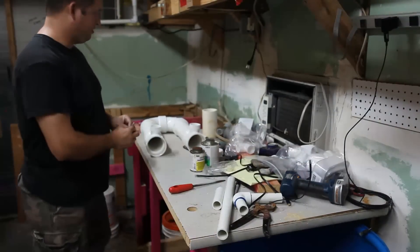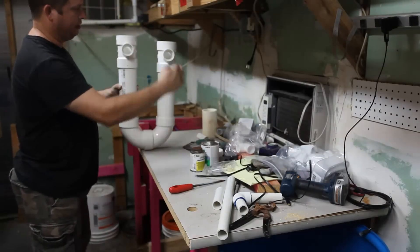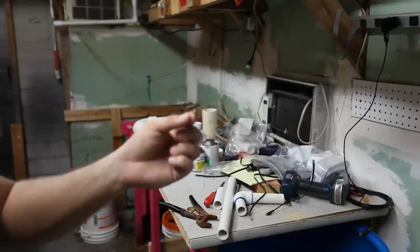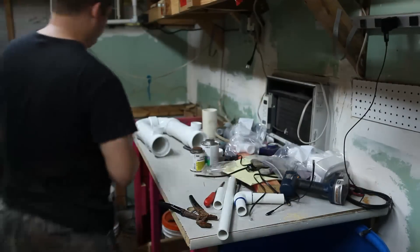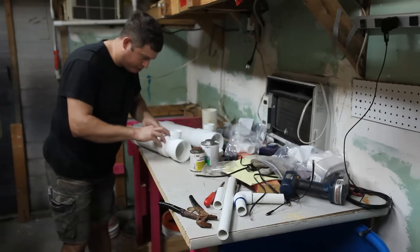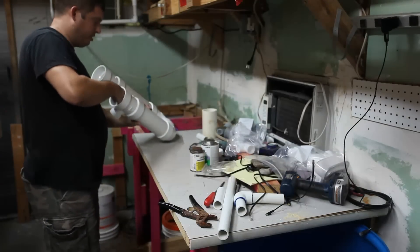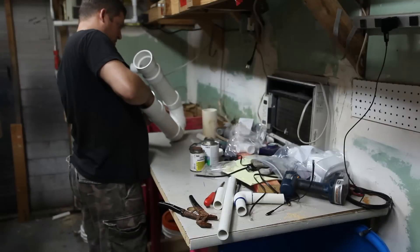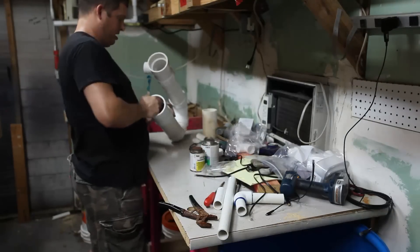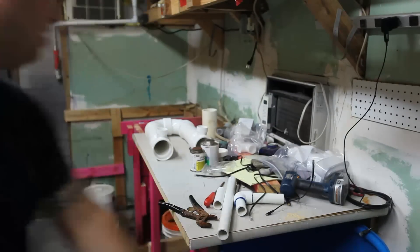I have assembled the majority of this and you can see the water will enter here, go down, go through here, and come out this part. I'm about to install the second sight glass. I have created my little stub of glass which you can see here — I've flame-polished both sides. So what I'll do is insert this into the hole where I want it and then just smooth it over with some silicone. It's always good to smooth over the inside as well. This one's not quite as perfect as the other one but it'll work — it sticks out about an eighth of an inch inside the pipe. Still fine.